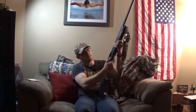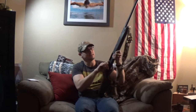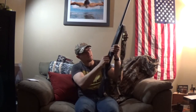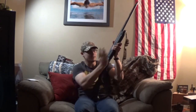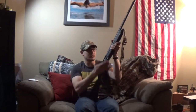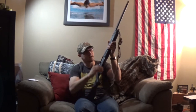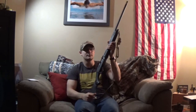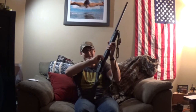The charging handle gives you a lot to grab onto — it's really nice. The bolt release itself, when a gun is first out of the box — and I've seen this across multiple new guns in the store — you press it down and it would kind of let go a little and then chunk forward. As you shoot and operate the gun more, it will get rid of that; it's just a little hang-up in the tolerances. If you slap the bolt forward it may not always close completely, but the charging handle is large enough that you can give it a slap and it will go into battery. Some people have reported losing the charging handle — I would keep an eye on it. A stronger detent ball and spring, as well as a deeper cut, would solve that problem.